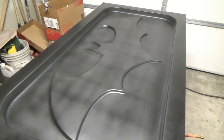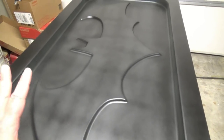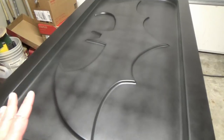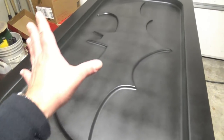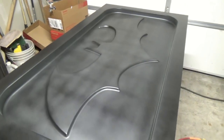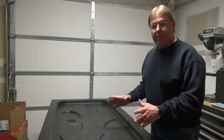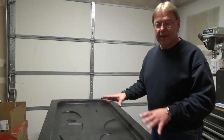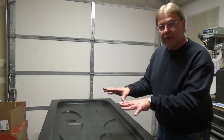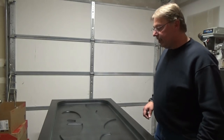That's what we're looking for. We've got several fog coats on here and it's looking pretty dull, which is what we want. The first five or six coats you fog it on, then we're going to really open up the nozzle and give it a nice wet coat — it should turn out nice and glassy. I'm confident how it's going to turn out. I'm going to continue doing this throughout the week since I can only gel coat and laminate on the weekend, but I want to make sure we've got good enough coverage that nothing is going to stick this time.